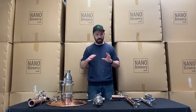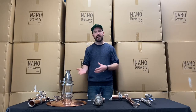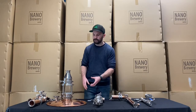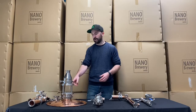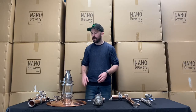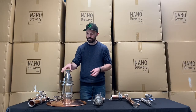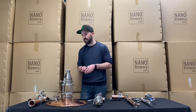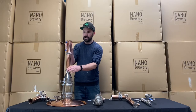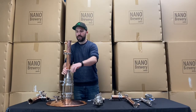What I've done now is broken down the still we just talked about to give you a little demo of the main pieces and how you build this up. We've already got constructed your domed lid, and on top of the domed lid you've got that four inch sight glass. On top of that four inch sight glass, you've got your reducer with your clamp, reducing down to two inch. This is where we're going to add one of our stainless steel beaded seals — it's got the mesh there — straight on top of that reducer. Then on top of that you're going to have your straight piece, your packing section, added directly on top. On top of that straight piece is where you've got your reflux condenser.